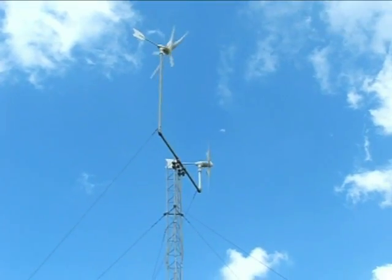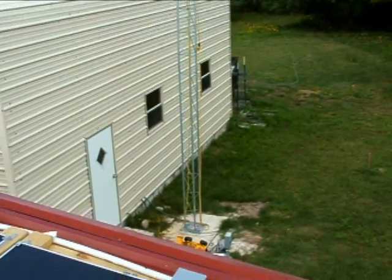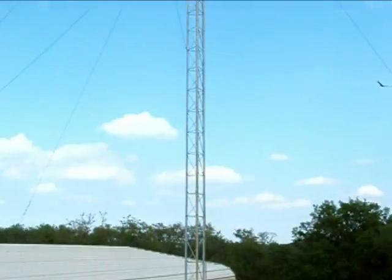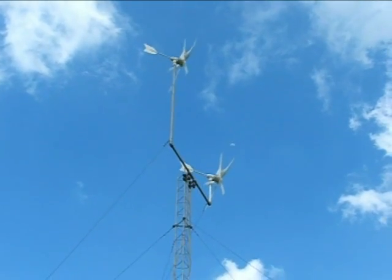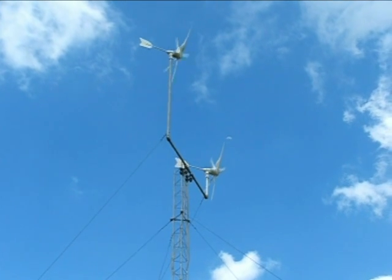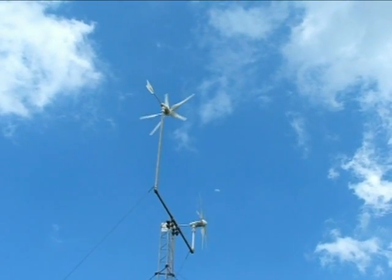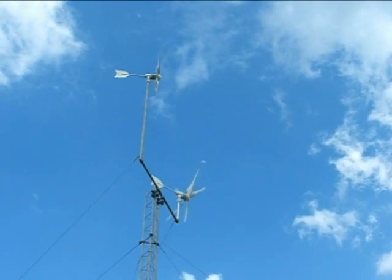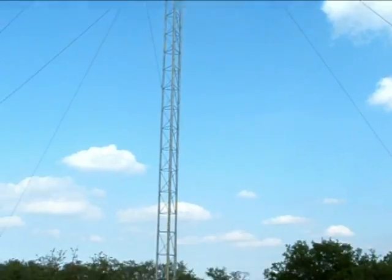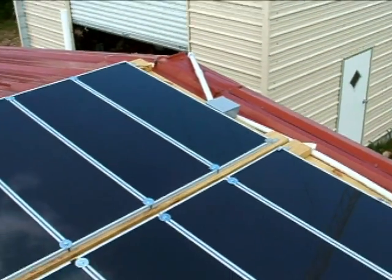A total of two kilowatts of solar plus two kilowatts of wind — that's four kilowatts. I'm in the process of getting an estimate on raising that tower up a hundred feet, so it's definitely worth it. I don't think I need to buy any more panels or wind generators. If I just take the tower up to a hundred to 150 feet, I think there's going to be plenty of wind up there to do what I need.